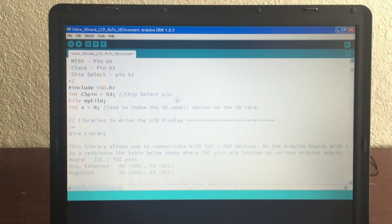For instance, let me just show you this offset right here. If the first code is 40 BE 768A, and then it's 40 BE 883C, and so on and so on. So basically this would be the power, this would be button number 1, and so on for all the buttons. You go to the offset as 0, and that's what this is. It starts out at 0, then you add 10, you're now reading here. You add 10, you're now reading here, and so on, reading all the characters until you reach the very last set of hex digits.